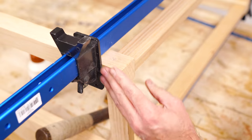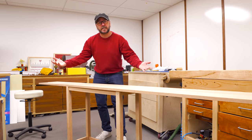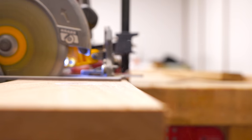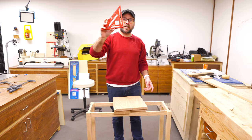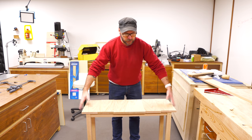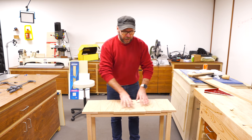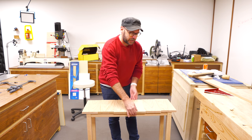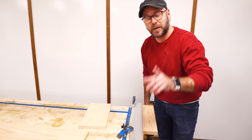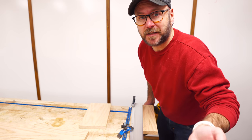The base is done. We could just glue a couple of pieces together to make the top, but let's get a little creative — let's have the grain go this way, so we'll cut a bunch of shorter pieces and connect them. All of the cuts we made today have been cross cuts using the speed square, and six of these makes the perfect size top for this table. I'm going to play with the widths a little bit, so I'll clamp a straight edge onto some of these boards and do a rip. If you don't have the right clamps you could use double-sided tape to tape down your straight edge, run your cut, then pry it off. In woodworking there are many ways to do nearly everything.